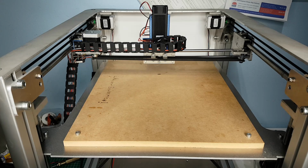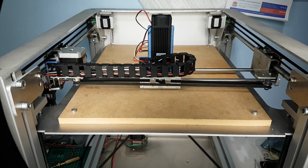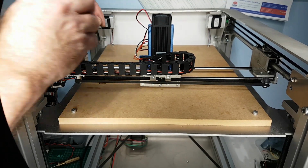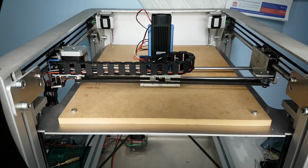But prior to that, I just want to check out if the mechanism is moving accurately. So I'll be using these 10 mil increments to start with, and then we'll work it down to smaller increments. Okay, so for this, I'm going to use a really super scientific method. No, I'm not. I'm going to use a pencil, and I'm going to jog the XY. So here we go with a Y jog. And so I know where I'm at. Got to keep the pencil at the right angle when I do that.